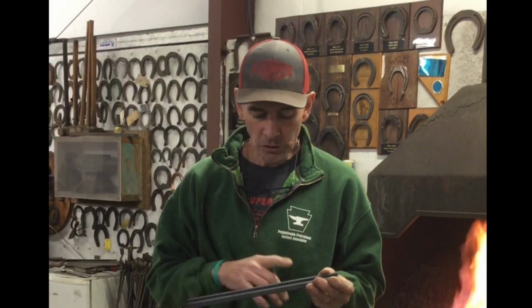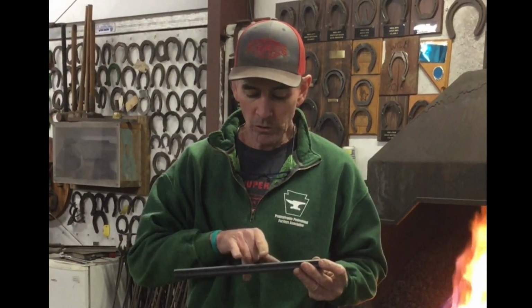We're going to bump the shoe to begin with. Usually you don't bump concave, but you can bump concave, and once you turn the toe, it'll bring all your lines back into normal. They get kind of blobby and discombobulated, but as soon as you make that toe bend, they're back to normal, and then we'll show how we do the diamond toe bends.